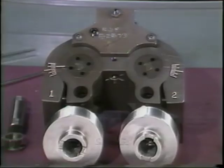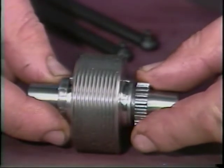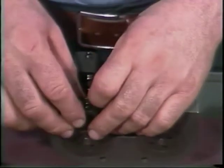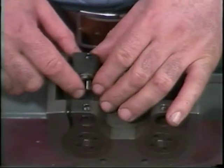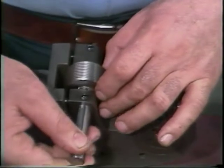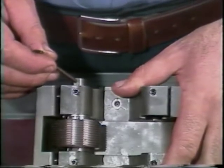Each roll in the set is marked with either a C or a D. Both rolls are also marked with a matched line. The roll marked with a C fits into the number one arm, and the D roll fits into the number two arm. Notice how the roll fits between the drive gear and the thrust bearing. Place the thrust bearing in the lower part of the arm, and the drive gear in the upper part. Now hold the roll in position while putting the roll pin into place. Lock the C roll into the number one arm. The flat area on the end of the roll pin should be positioned so that the set screw is holding on this surface.